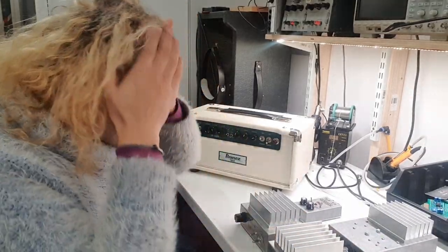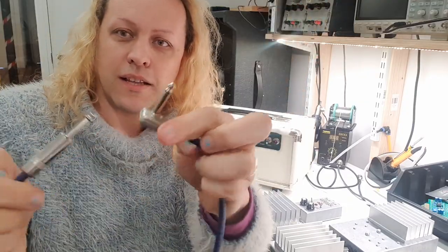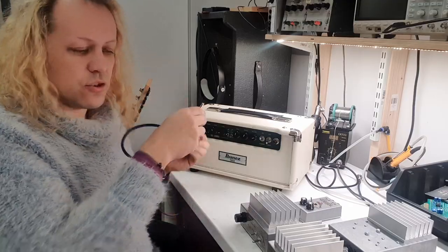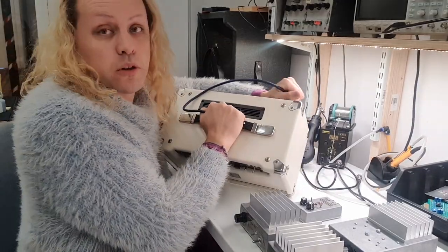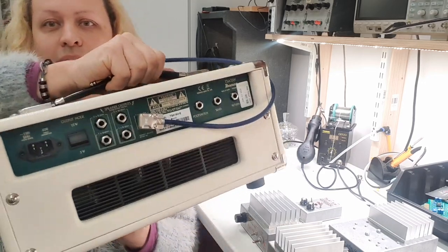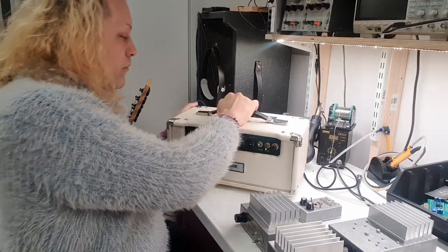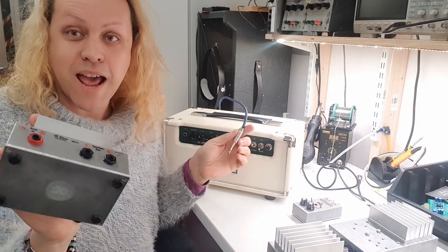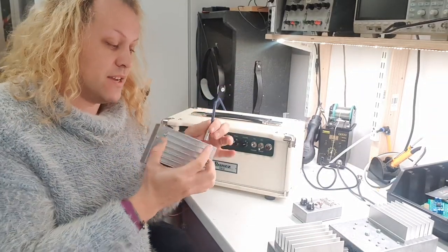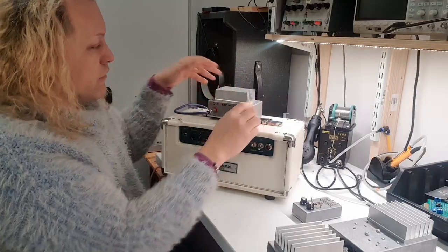Now I'm going to show you how you plug some of this in. I'll pick out the cables we want — a little half meter. I like having a right angle at one end and straight at the other because some amp locations suit one or the other. I'm going to plug the right angle from the speaker output — I've chosen the 16 ohm output in this case — into the red input on the Hotbox. It's red to red; it says 'Amp In.' Some amps have a red jack on the output, so it's generally red to red, simple as that.